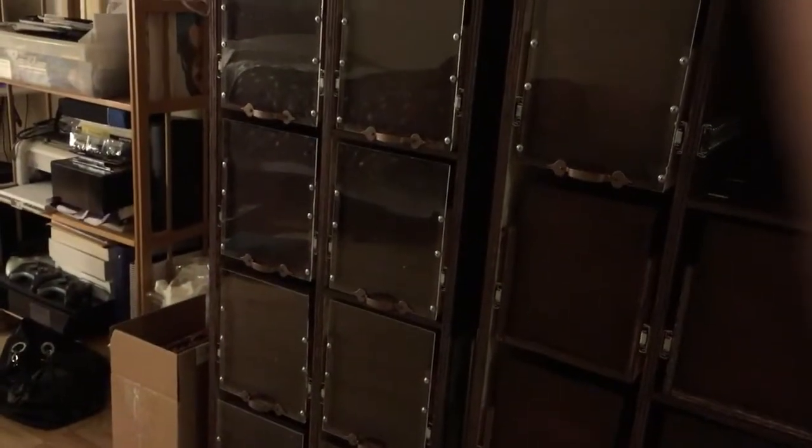I placed the board just underneath, allowing for a half-inch clearance. It worked out pretty well. I put about two pocket holes in the middle of the piece, and it kind of blends in — it doesn't stick out too much. In the future, if I made another one, I would just build these pieces in from the start because I like the look of a finished drawer with this bottom piece. It helped hold everything together and saved me time, as several drawers then went in and out easily.